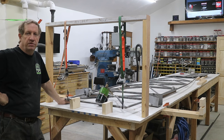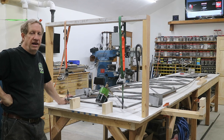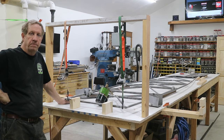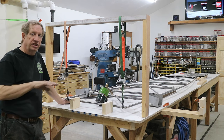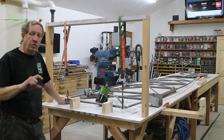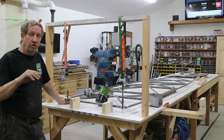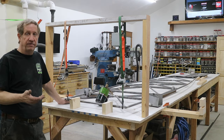This is what I've rigged up to bend the nose here. So basically, I have the frame sitting on the 1-inch cross tubes on a piece of 1.5-inch square tube. Now that's the 1-inch tube. The drawing showing you the longerons on the side, which is the 3/4-inch tube. So I'm basically 1.5 inches on the square tube, plus another 1/8 of an inch to get up to the bottom of the 3/4-inch longeron. So 1 5/8 above the tabletop. So I need to bring it up 2 inches to 3 5/8.